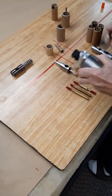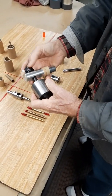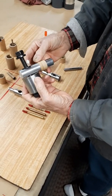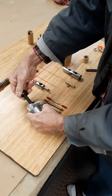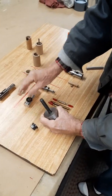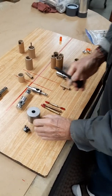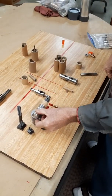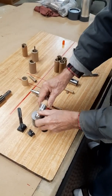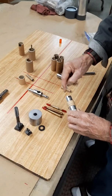These are some of the other dies, punches and dies that make up for use on the milling machine. This is the one that was being used. This is a block that's surface ground on both sides and gets bolted down to the T-slot in the milling machine. You can see how that works — spaces for adjusting the length, positioning where you want the hole in relation to the end of the tube.